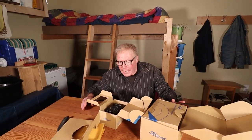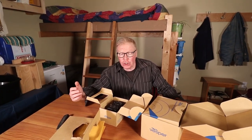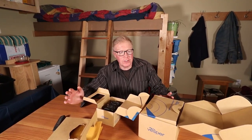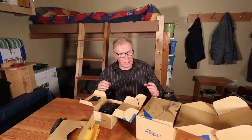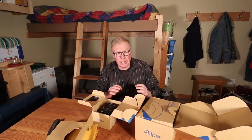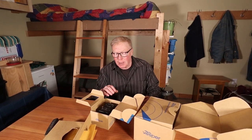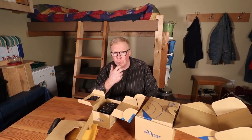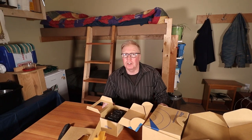So Ray had reached out to me a little while ago, and he said, I've been following the channel for a while. In the channel, I had said the one thing I would change about the way I had Wave Rover set up was that I would like to have an AIS transmitter on my next boat, because AIS, which I had never used before the last Wave Rover voyage, was just such an aid to the solo sailor. It really didn't take very much power, and it came through on the VHF, but what a difference to be able to identify a ship by name, a speed, a closest point of approach, and reach out to them by VHF and let them know you're there. It was wonderful and really gave me that feeling of security.